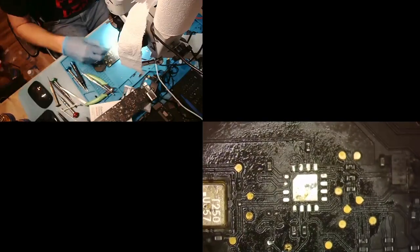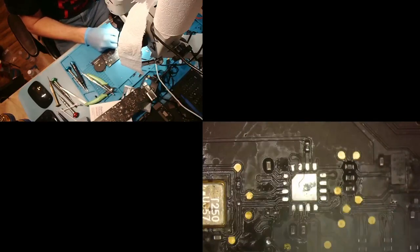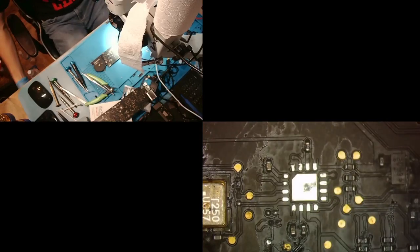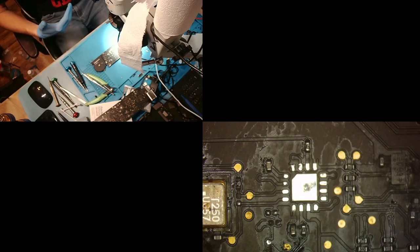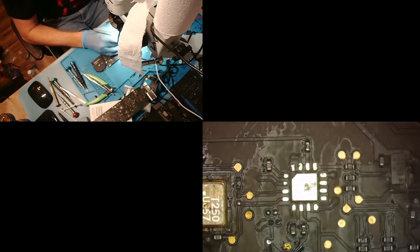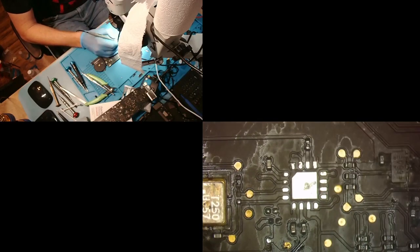But another reason is that I like to see, it happened perfect. If I wick it and the pad is barely hanging on, what will happen is the pad will actually damage itself, right? So I know that me wicking the pad isn't damaging it. But I know if I get a pad and it comes off and it looks like this, that is a pad that is damaged, right?